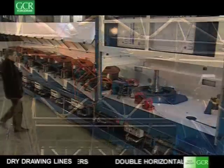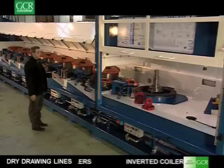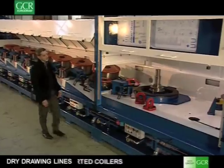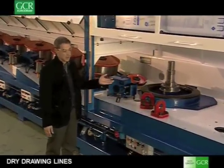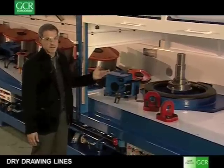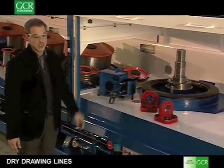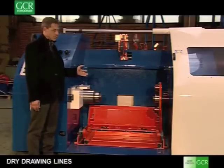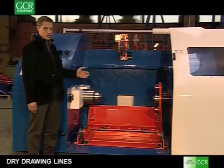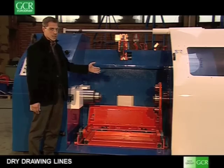Both MTS and MTX machines are assembled in our factory in Pugliano Milanese. We can equip them with a full range of accessories, just like this one that you see here under assembly, which is a stripper block used to make small coils of spring wire. The machine can be combined with any kind of take-up. In this case, we have a spooler equipped with a spool elevator and a conical winding traverse system. But many other take-ups are available, according to the specific customer spools, coils or needs.